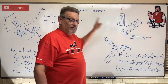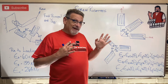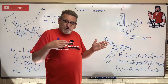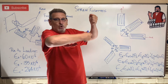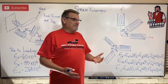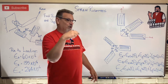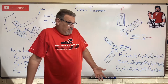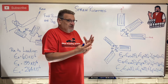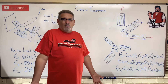Welcome back — today we're talking about strain rosettes. We introduced strain gauges last time: strain is directional, and strain gauges only work in the direction of the strain. So if a bolt is getting stretched, the strain gauge has to go on in the direction of the stretch. But what happens if you've got a big pressure vessel with a torque on it, a load on it, and pressure on the inside? I want to know what the stress is on the outside — and I don't even know which direction it's acting.